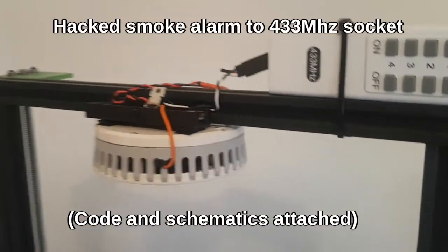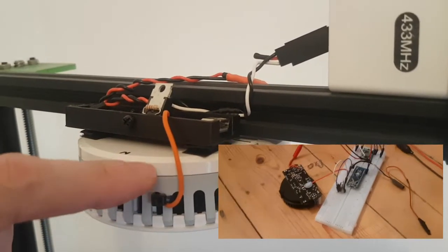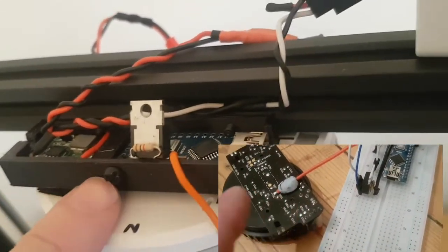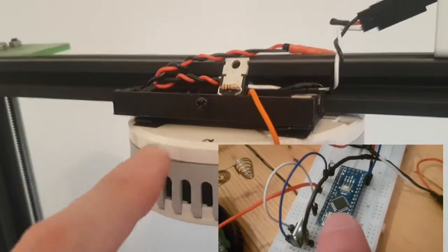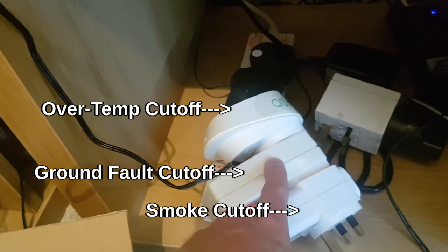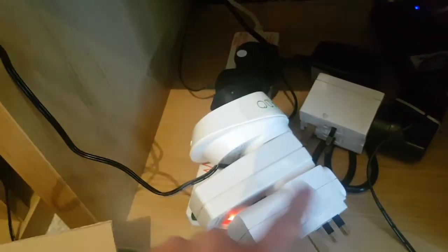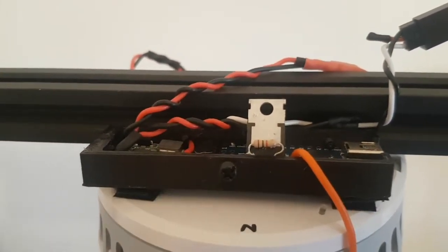The next safety thing I did was a Fire Angel smoke alarm — five quid from Wickes. I found which pin goes high when triggered and wired up a little Arduino Nano with a step-down regulator. Similar to the Atomax: when it detects smoke, the pin goes high, takes 9 volts and sends it as a 433MHz signal through a transmitter that shuts off the smart plug. So: temperature misbehaves — cut power. Ground fault shenanigans — cut power. Smoke — cut power. Any of those three things happen, power is cut. I'll list the code and a schematic in the description.